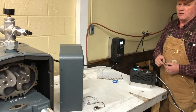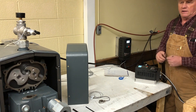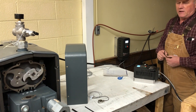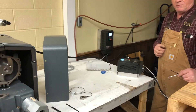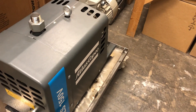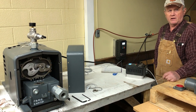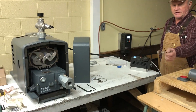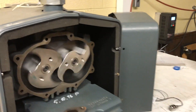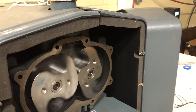Last year we had it set so that once we got to 27 inches, it went back to 35 hertz and kept the woods at 27 until we had big runs or leaks and needed to catch up. The first year at Bissell's we ran that bigger pump on a 20 amp breaker with a piece of number 12 Romex wire — what you wire your house with — and we saved 50% on electricity. These pumps are very, very energy efficient. The motor's back there; that's basically all there is to it.